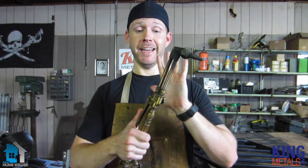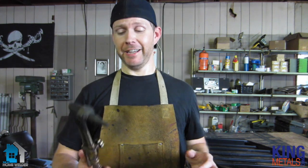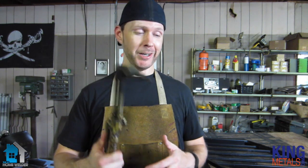Well, you're going to need a torch. Torches are great because anyone can get access to a torch. All you need is an actual cutting torch, a line, and an oxygen and acetylene tank, and you're ready to go. You can get these at any welding supply store. If you've never used a cutting torch, it can be a little intimidating at first because you have different gas flows, two different gases you're working with, and a trigger on the gun. So if you've never used one but you're realizing you do want to get a torch, I'm going to give you a three-step process to get started.